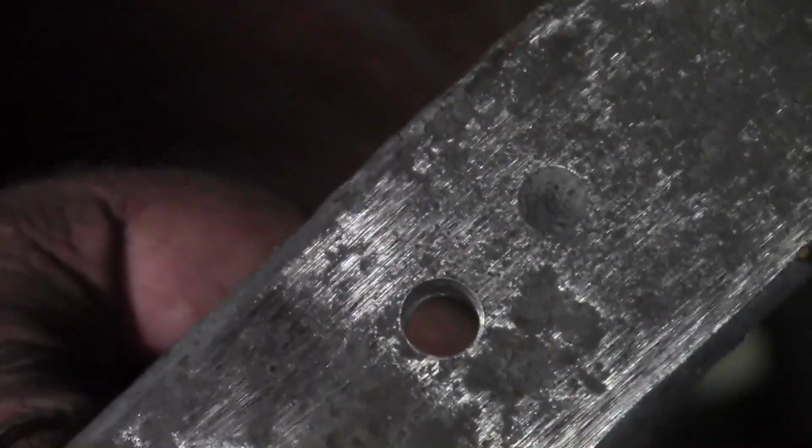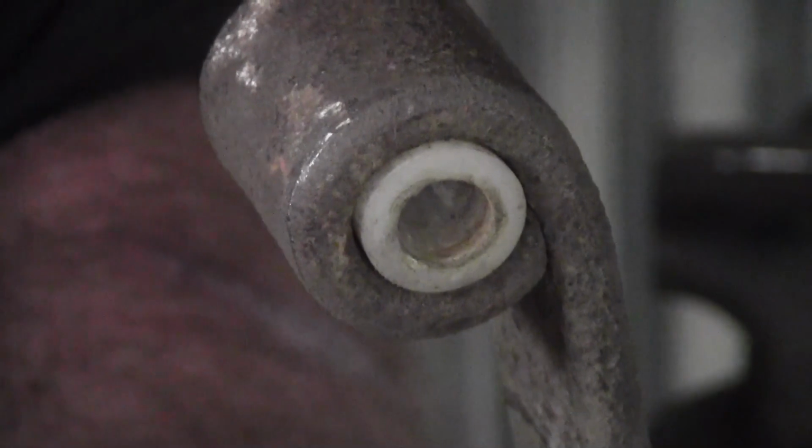Okay, there we go. It's about a quarter inch thick. So it was a little hard to drill, but it was definitely soft. Bring it into focus. You can see there where it started chattering the other day, and it drilled it. And that is a leaf spring. So most assuredly, it's probably 5160 or something very similar.